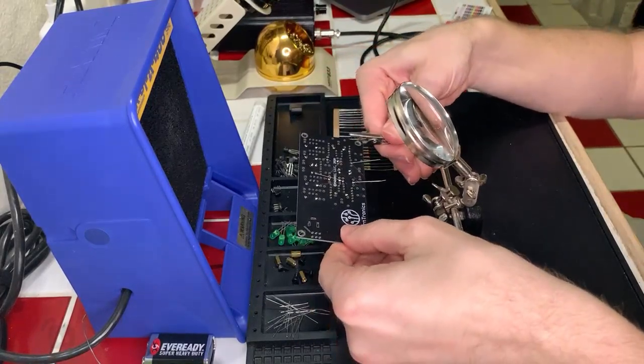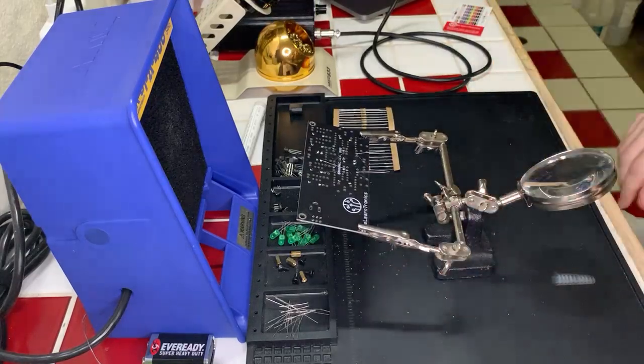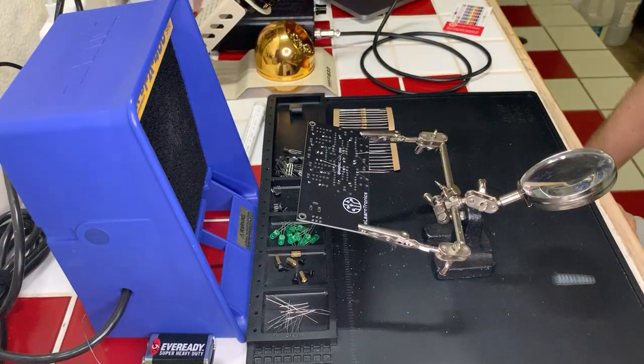And sorry, I do see your comments. Just a moment and I will look at them. Okay. Yes, flux is to remove the oxidation layer so that the solder adheres better. Having it in the solder can sometimes have the solder get into the joint before the flux gets to it, or the flux not covering the whole joint before the solder adheres. Ah, I prefer fluxing beforehand to ensure the flux covers everything it needs to before introducing solder. That makes sense. Okay, I understand that.